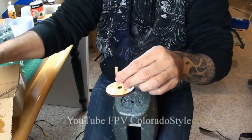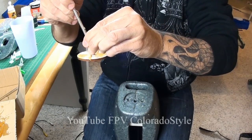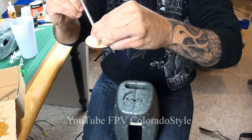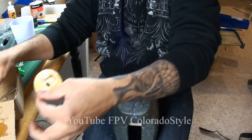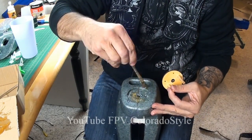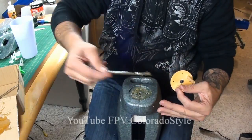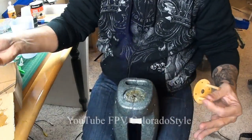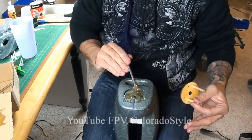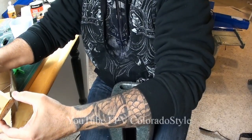I'm making sure I get glue on all surfaces. An important thing is to keep it away from the edges on the outside, because this stuff does foam up pretty well and you don't want it oozing out everywhere. I'm putting it everywhere around there for a nice good coating, and I'm putting some down inside the holes as well so that when it expands it'll come back out. I'm also putting it on the dowels on the motor mount so that when I shove it in, the glue is not just on the holes but also on the dowels.